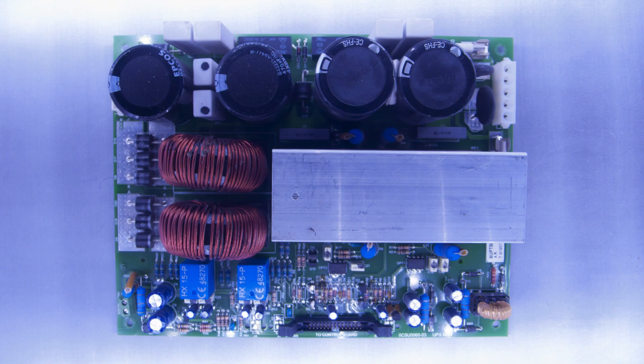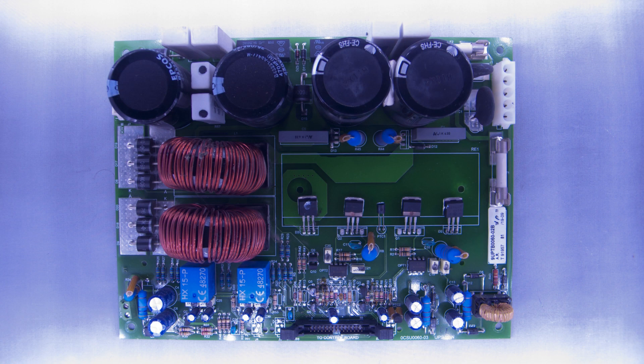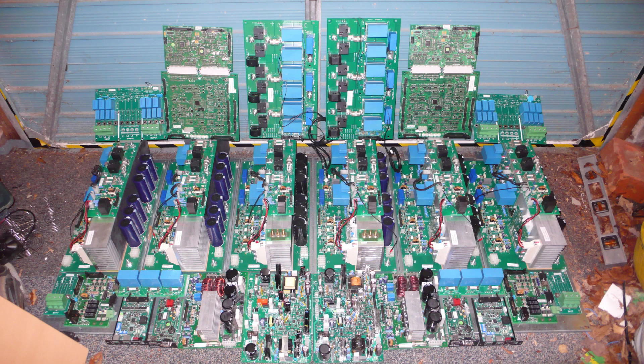The final board is what the fourth fan on the back is for. The board itself is labelled AR; the control board refers to it as CB. It might be some sort of supplementary battery charger — it's got a 5-pin output connecting to one of the 12-pin power board interconnects, with 16-amp fuses, more big electrolytics, four small relays, two IGBTs, two diodes, another pair of opto-isolated driver circuits, and a connection to the batteries via a pair of small toroids. I forgot to film it with the front panel off exposing the breaker connections, but that'd be just a tangle of wires anyway.